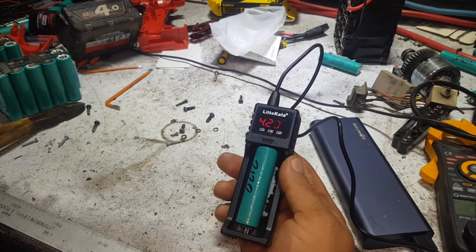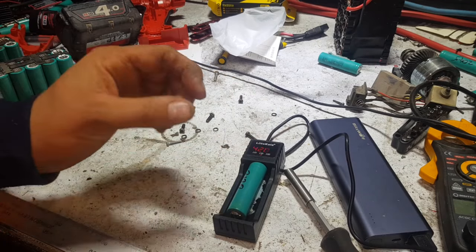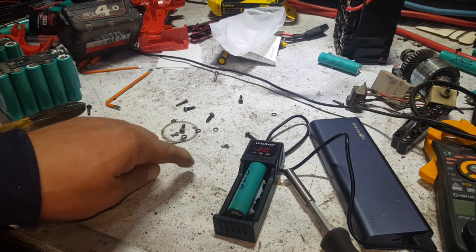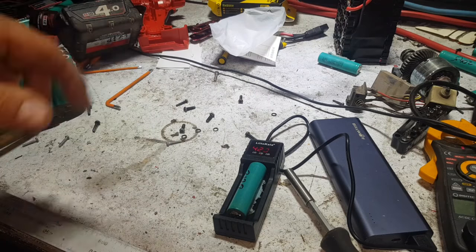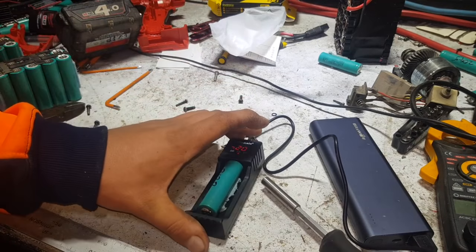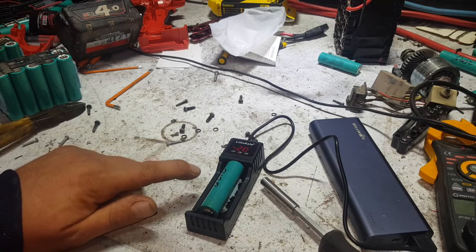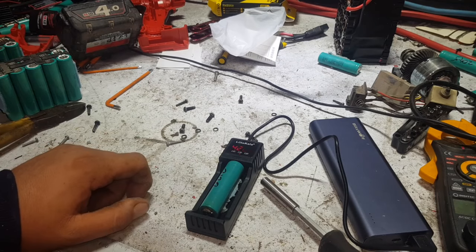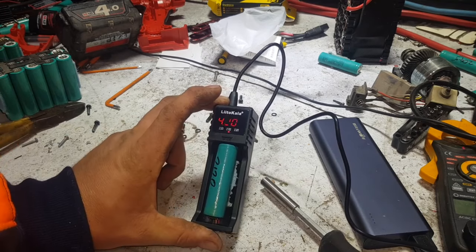That would be a very good way to make a pre-charging station out of these. I'll link them on Banggood, but there's like one normal USB to three or four micro USB cat-tail kind of USB devices — double-sided tape them to a bit of a board, a couple of USB power supplies, you get yourself a bit of a charging station that's nice and safe, 1 amp per cell, all low voltage, really simple wiring. These would be really good for some very DIY hobby kind of uses.